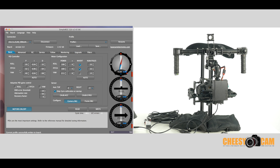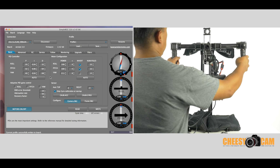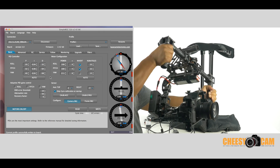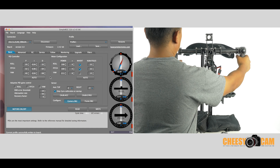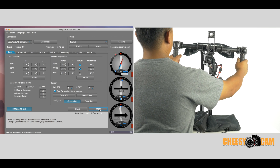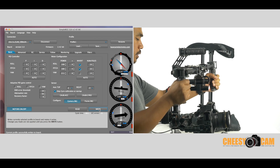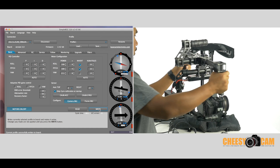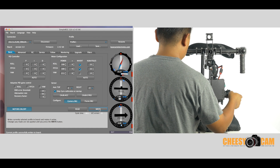We're here at the latest firmware. Let's go back to the PID tuning. I want to show you that my gimbal is set up and working, because what I'm going to do is wipe out my PID settings — I'm going to zero everything out. You don't have to do this, but I just want to show you that I'll break my gimbal and then hopefully auto PID tuning is going to save us. As you can see, it's not very stable anymore — it's actually twisting now. I broke my gimbal. It's not working anymore.